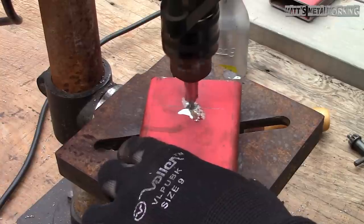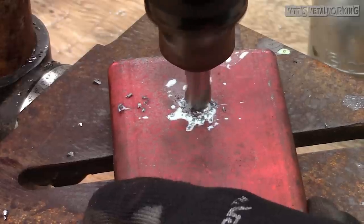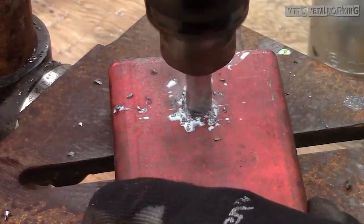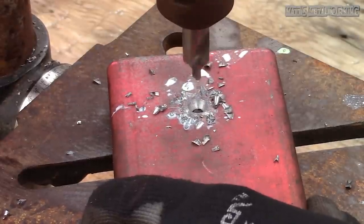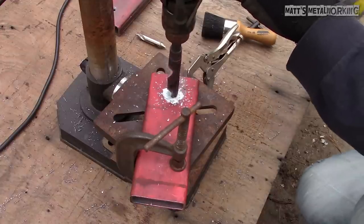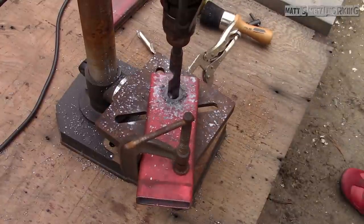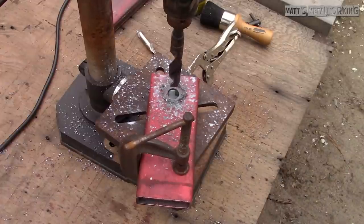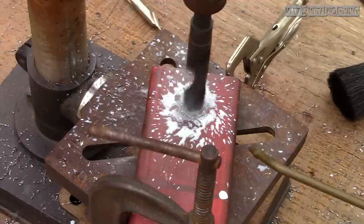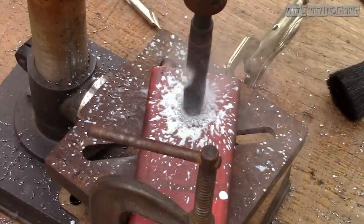The cutting fluid provides lubrication, keeping the drill bit cool, reduces the chance of burning out the bit, and helps make a clean cut. I picked the correct size of drill bit needed for the feed lines — this was based off the gasket size, which you'll see a little further on in the video. With a larger drill bit a slower cutting speed is needed and cutting fluid is a must. Being that this is a bigger bit there is a greater chance of the piece grabbing, so it's best to clamp down the workpiece instead.